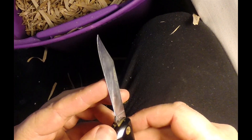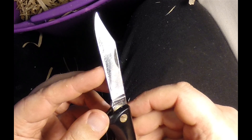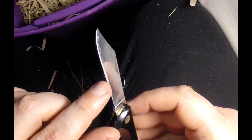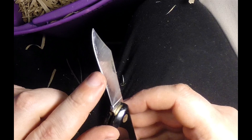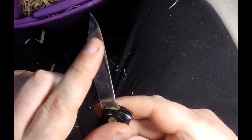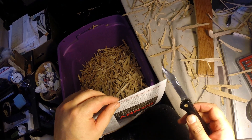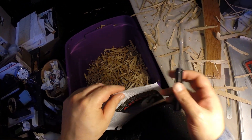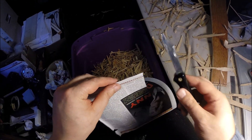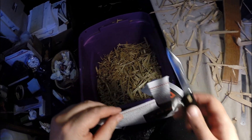Much better. Now I only have one tiny tiny tiny glint on the edge, right where my index finger is — I'll throw a blow-up on screen. So I'm almost at the point where I have the necessary level of durability. Now I repeat the whole process: I increase the edge bevel to twelve degrees per side, put the micro bevel back on again, check the sharpness, and then do the wood cutting all over again.